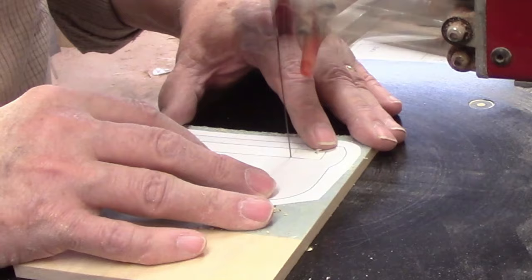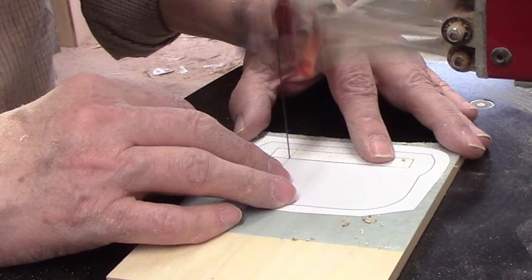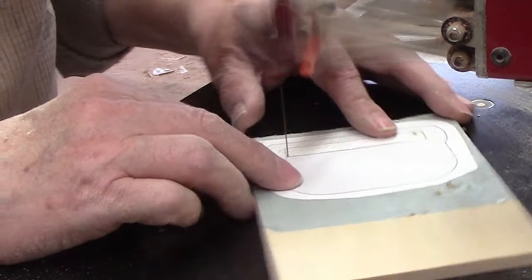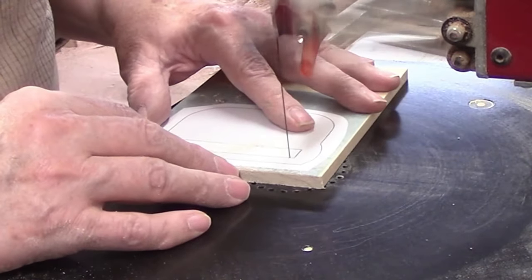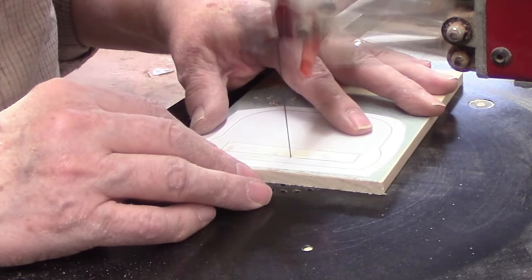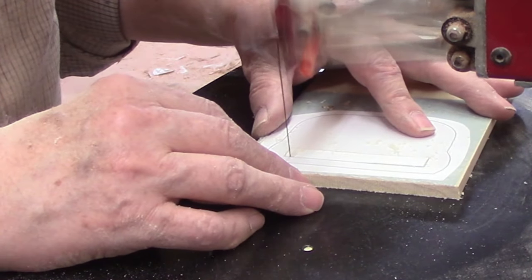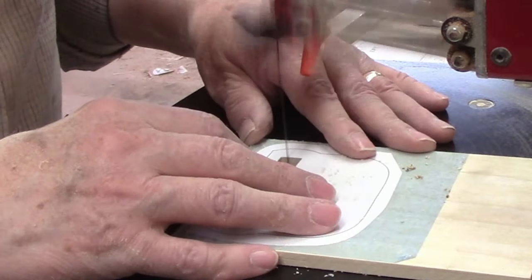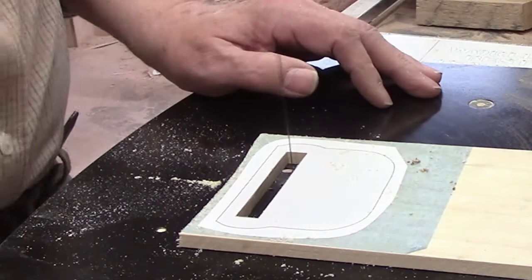Sometimes the blade won't back up quite all the way — if so, don't worry. Just start cutting where you can, cut to the line and follow it around. Once you've completed the cut, you can remove the waste piece and clean up any parts you weren't able to reach before. Once you've got around to the second corner, you'll have to use the second method for corner making: cut until you reach the corner, then stop and back the workpiece up just a tiny bit so the blade is no longer cutting. The kerf the blade just created will give you enough room to swivel the workpiece 90 degrees to the new direction. Once the blade is aligned, put a little pressure on the workpiece to feed it into the blade once again. Every time you get to a corner, just follow the same procedure.